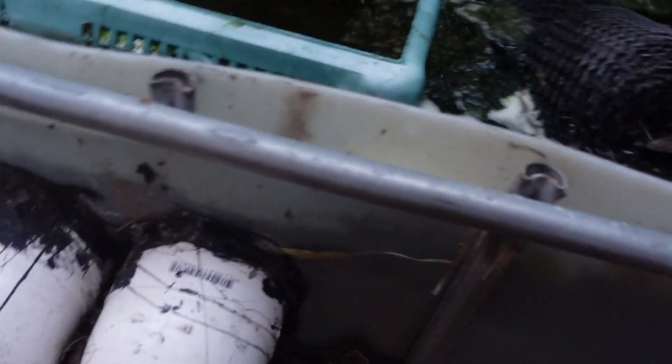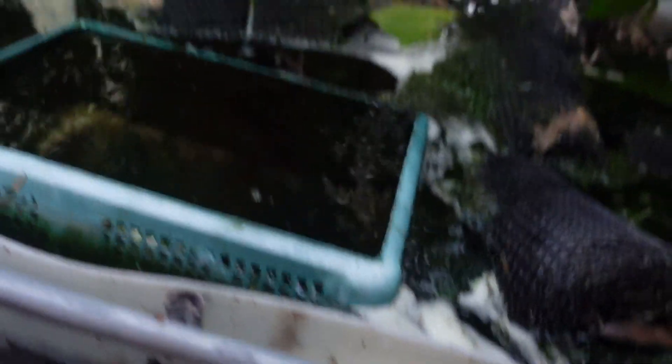The other leak is just here — that's actually got way worse since I last looked at the problem. The Sikaflex shrinks, so I need to get onto this one like yesterday — that's not good. It looks disgusting with all the algae. I don't mind the algae in here, I just don't want it in there. Then there's this overflow over here — this brick is falling in, and the basket is all scrunched up. The basket's supposed to be stopping this gutter guard from going over, but you can see it's just chomped up.